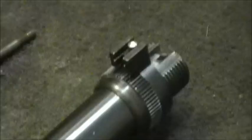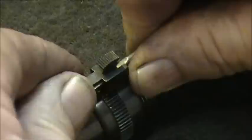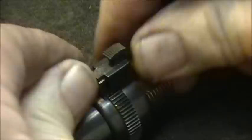So now I will take, and you'll need a little old jeweler screwdriver or something to push down your spring here. And so you put your adjustment ring latch in place here, and try not to lose your spring and plunger, but don't worry, that happens all the time, and Browning's got them, there's lots of them. So push that down, get it out of your way, and then push your adjustment ring back on. Then you can put your forearm back on.